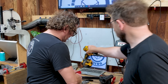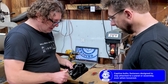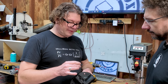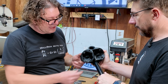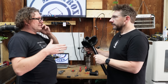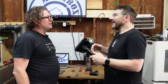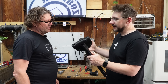Captive bolt is another technique they spent many hours perfecting. An M8 by 25 standard bolt goes into the part — just like that, and it stays captive because there's more space on the inside. You're not trying to hold it rigidly steady, just hold it in place so it doesn't fall out. You leave it loose and then tighten it up on final assembly, pushing against the axis.